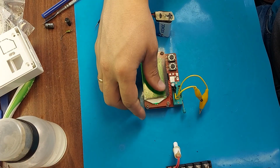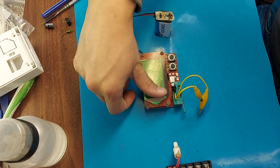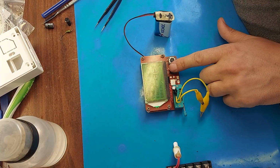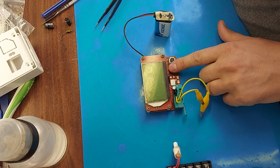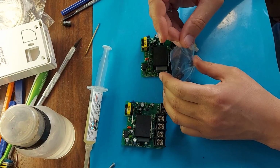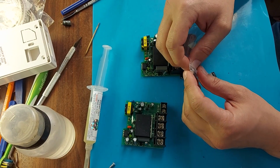I also suggest checking the capacitor from the working thermostat and comparing the characteristics. The capacitor shows almost 2.2 microfarads and ESR 8.2, which is much lower than with those two capacitors. Therefore, you should still change them.